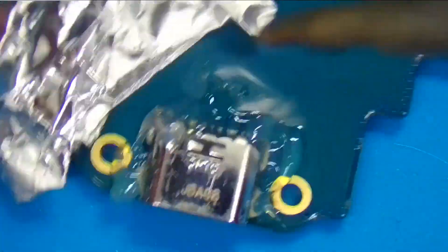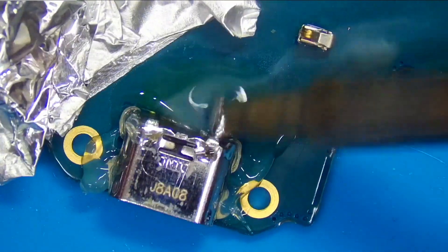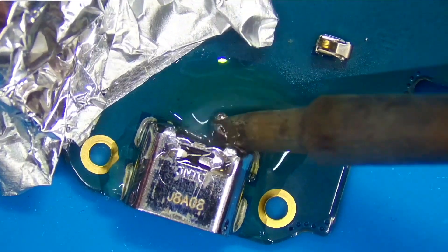Number one: most factories today that manufacture electronics use lead-free solder. Lead-free solder does work, but it requires more heat from your hot air station or your soldering iron, and it doesn't seem to flow real well either. So if you've tried to solder something and the solder doesn't seem to melt, don't worry, you're not crazy. You can use leaded solder to flow and mix with the lead-free, ultimately lowering the melting temperature.